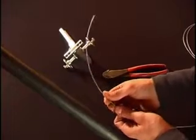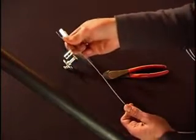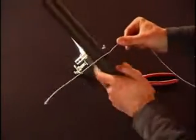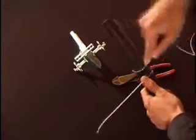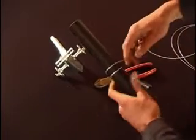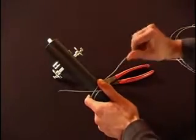Begin with a 160mm piece of wire to form the leg of the V-clamp. Bend it twice around the pipe and extend a straight piece which forms the second leg, and cut it off from the coil.